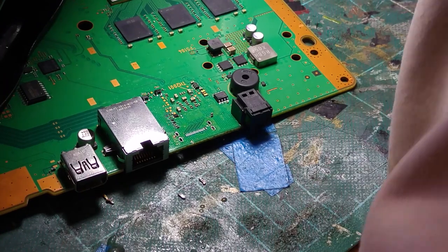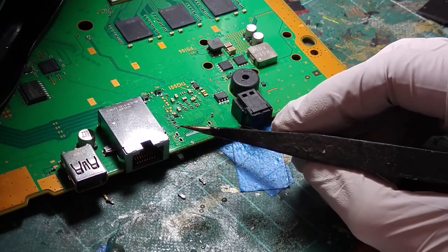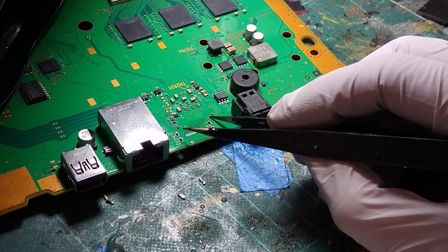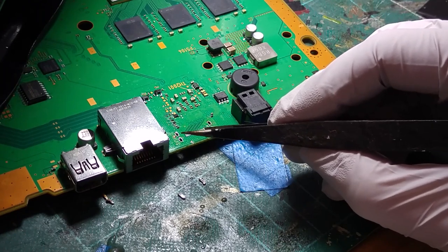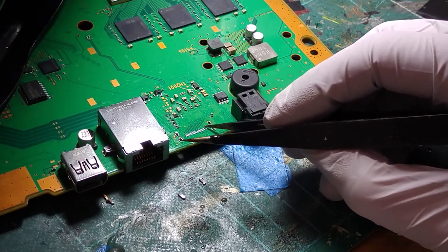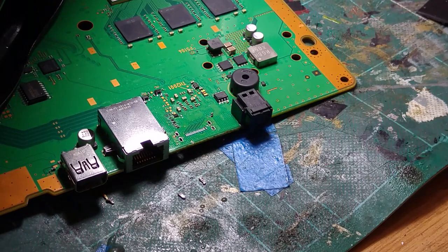Okay, let's have a look at what we've got. You can see there quite nicely that missing pin — pin 18, second pin in from the right. That goes to a little via just there, and then hops onto the back side of the board. What it actually does is it comes off the back of that pin to this via, goes through the board and up the other side. I'm thinking about whether to run a link wire or try to create a new pad.